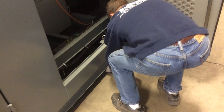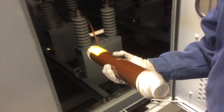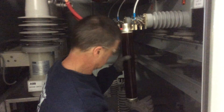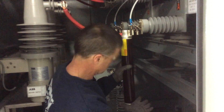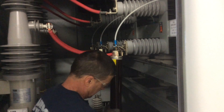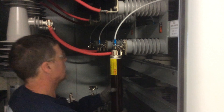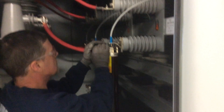Retrieve the fuse. Note that the fuse has a top and a bottom — the top has a paper membrane on it and a yellow label. The top part of the fuse needs to point towards the blown fuse mechanism, which is the blue area with an actuator protruding. Clip the fuse back in.